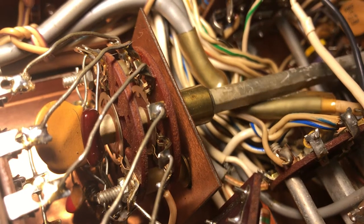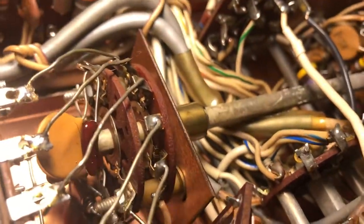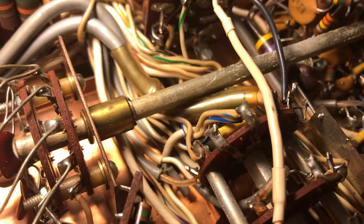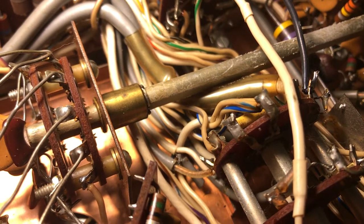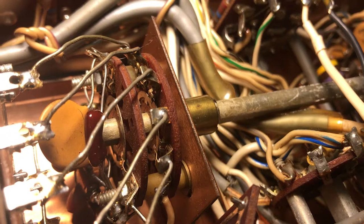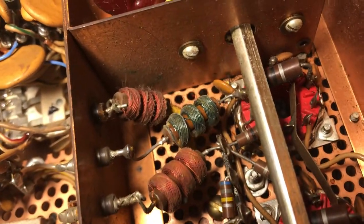You can see where there's some backlash, and this will simply not work correctly — well, it's not that bad. I did go to the bands in previous videos and it seemed like the switch did work. I just don't like how I can visually see it missing — it could be between two different crystals or coils. The shaft is moving, so maybe it's the wafer itself that's worn. It's not bad enough yet to replace it, and I'm not sure I'd want to. So it looks like on the to-do list: replace the feed-through cap, which looks really bad.